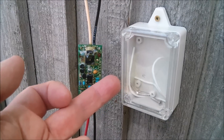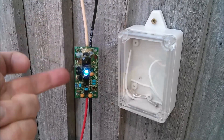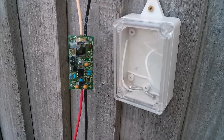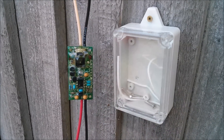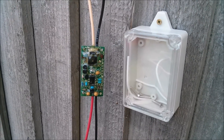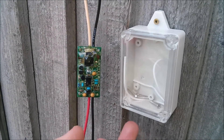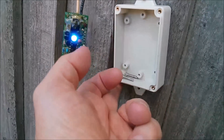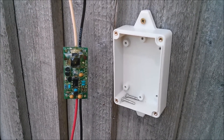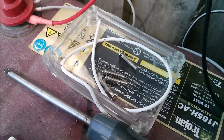The solar input yellow and black won't come in from the top - it'll be wrapped around and all four wires will come up through a hole in the bottom. The lid will be screwed on and that will provide a seal, but of course I'm not going to have a proper seal because you can't seal anything against the British weather. So you've got to accept that moisture will get in - why not have a hole in the bottom corner, tip it at an angle, and just allow any water that gets in to drain out.